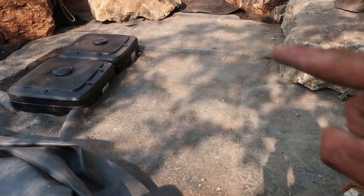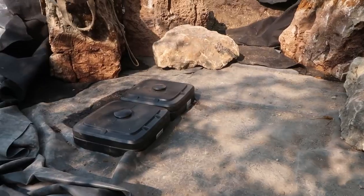The thing you need to be concerned about is the infiltration area itself. You are taking a very large footprint and condensing it down to a very small footprint, so we're only using a fraction of the infiltration area — that's where all the debris is going to collect in a centralized area. You don't want that infiltration area to be too small, especially with a lot of overstory trees, or this thing will get clogged frequently during fall leaf drop or spring when flowering trees are dropping windblown debris into the reservoir. If it gets impacted and clogged, the water travels over the infiltration area and outside the liner and you start losing water because it can't get down to the pumps fast enough. It's a mistake I've made at my own house.